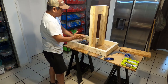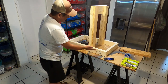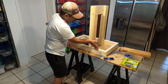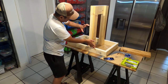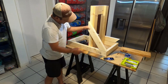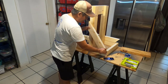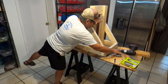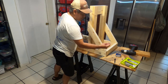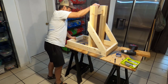I need to figure out the best way to add some bracing here. I've got to cut an angle - if I measure it and duplicate it on that side, it'll be square. I can use the jigsaw or the handsaw to cut it down. I cut these corner side supports and I'll put one screw there and one screw there. Boom - we're done. 24 screws used, one left over out of a 25-pack. It worked out perfectly - sturdy as a rock.